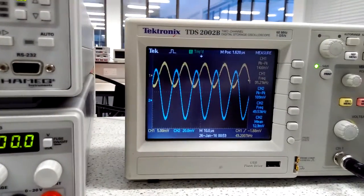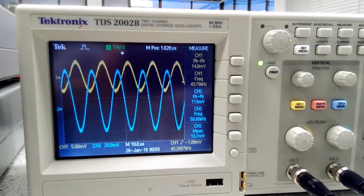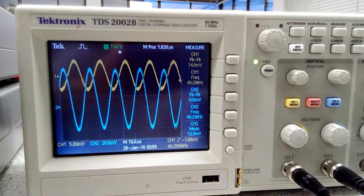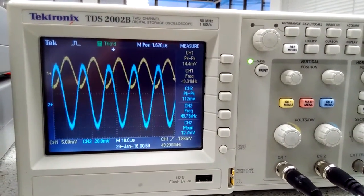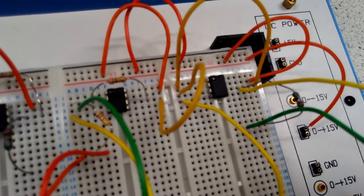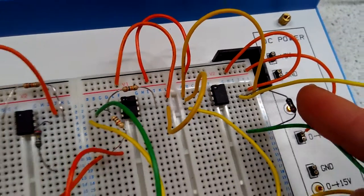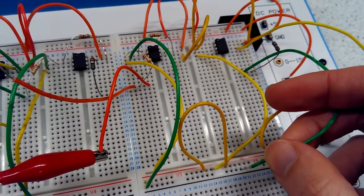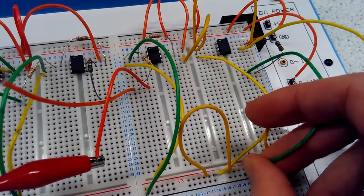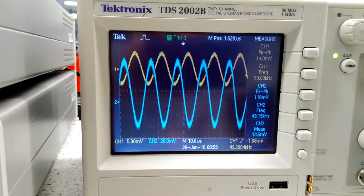All right, so here we are before we attach the load. We've got about 112 millivolt coming out. What happens if I suddenly attach the load? Almost nothing. So let's look at it down here. I've got a load attached. That's this 51 ohm right there. Has been grounded until now. I'm going to ground it. I've attached it. And almost nothing has happened because of the action of the buffer.